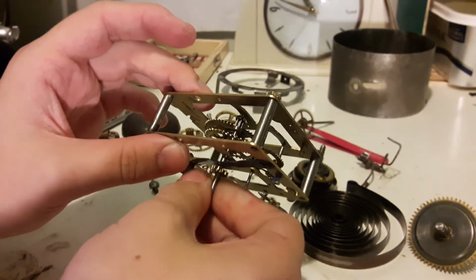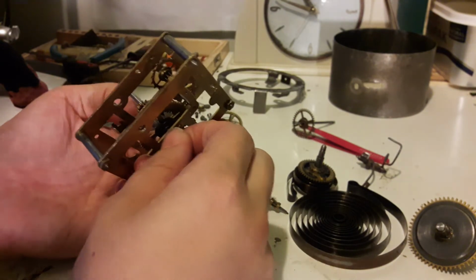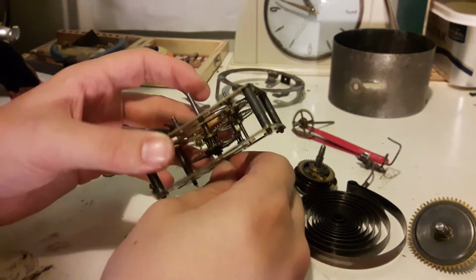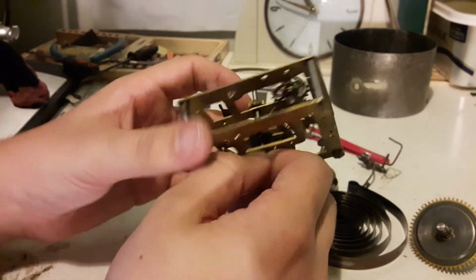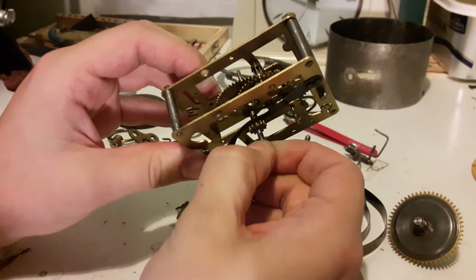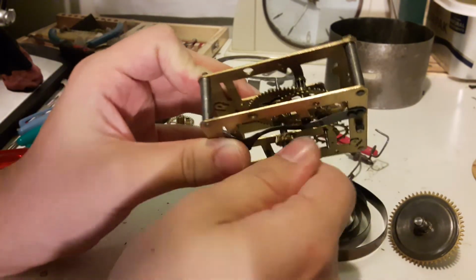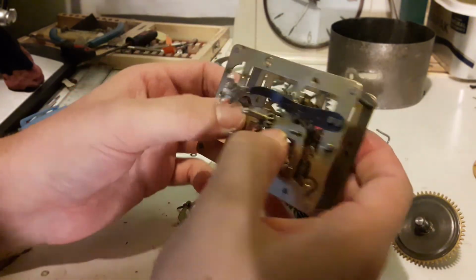This thingy seems a bit floppy. Tension in this centre rubber. I think I can sort that out. I'll also need to drive down this pinion a bit more, which I'll do now off camera. So I've actually driven down that pinion a bit more, with the hammer and a couple of pliers, and what I found out is it's still too loose on the tension there, but it's rubbing up against the plate because it's slightly bent in the middle.